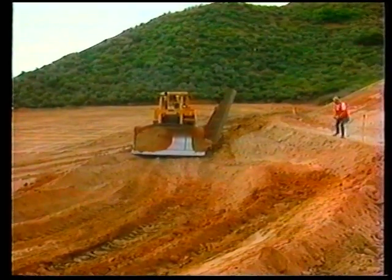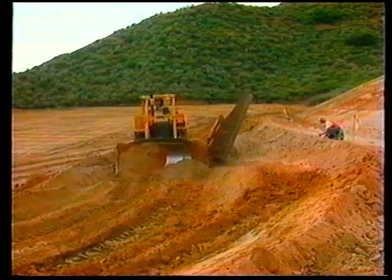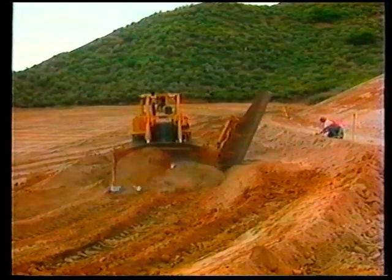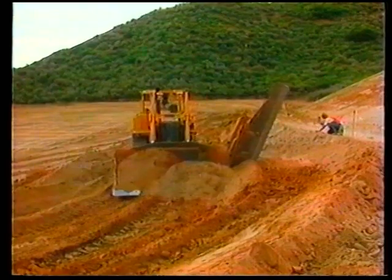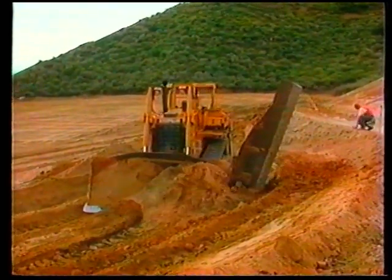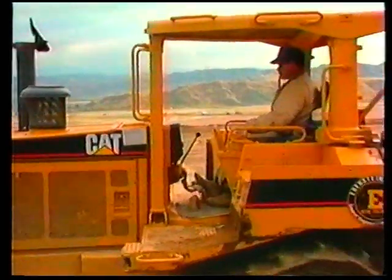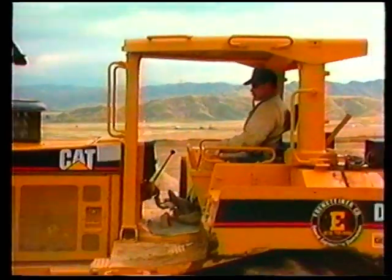To begin this technique, tilt the dozer blade level, then bench the excess material on the slope to the approximate finished grade, down below the top of the slope about one full length of the slope board. Continue this bench the entire length of the slope. The operator uses his judgment on making sure not to undercut the slope during this process.